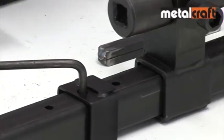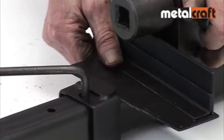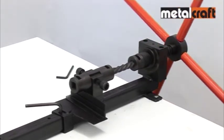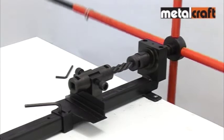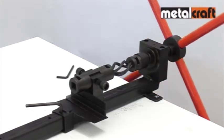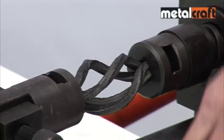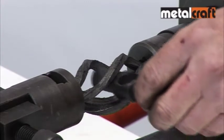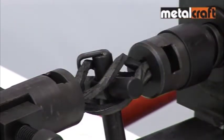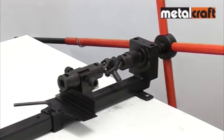Next, slide the specially designed wedge plate between the slide and the retaining lip of the end stop. Now you rotate the handles back the other way until all four bars in the cluster are fully opened out. Then, to ensure an even spaced basket, you drop the two halves of this clever spacer device into the middle of the basket, join it together, and hook it onto one of the strands. Now you continue rotating in the direction shown to form an even basket.